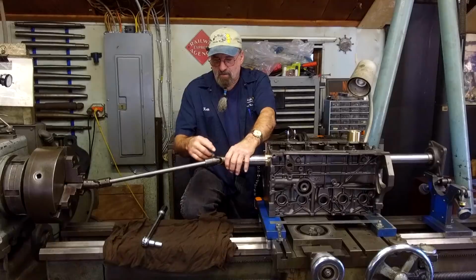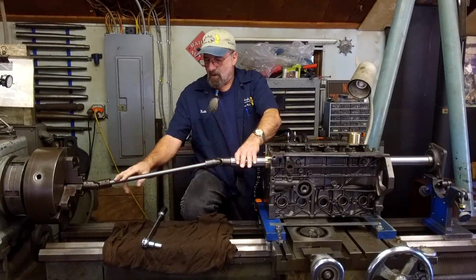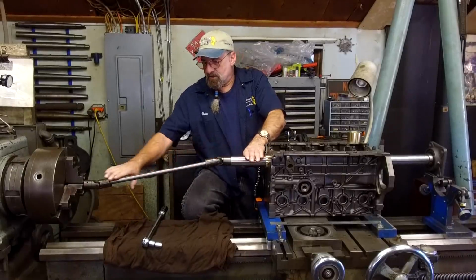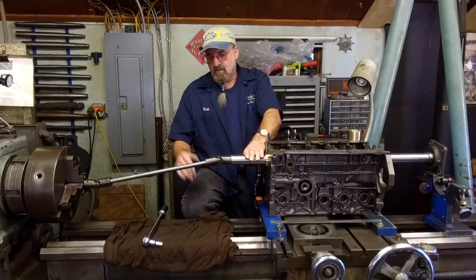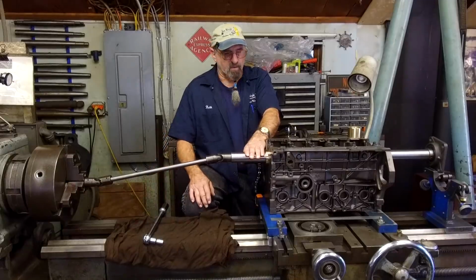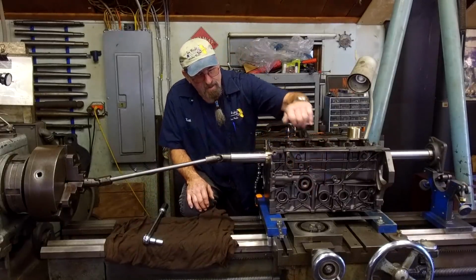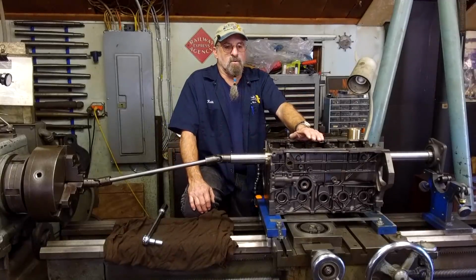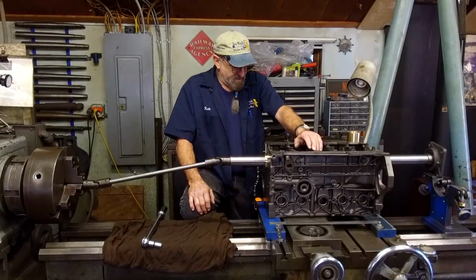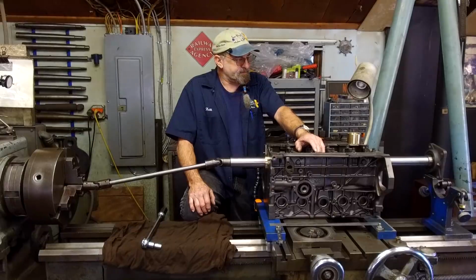I do have to mill a couple flats, and I don't have this all in here, but I kind of stuck a bar that I had. Didn't even have to cut it off, just dressed it up. And this angle is about 10 degrees now. 25 is the max, but why not give us some room? We'll set up a couple rags here. We might have a couple tools out here. And I also took the compound off that side just so that it wasn't something that was hindering a work area. It was a little bit in the way, I guess.